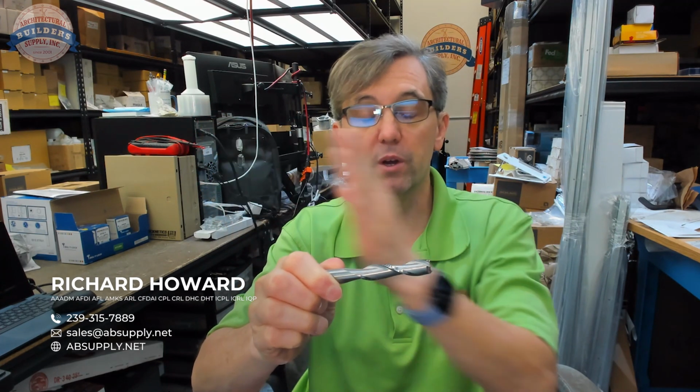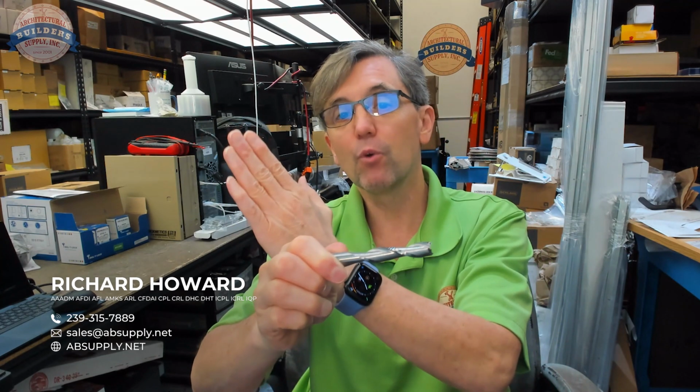As your tool bites into that, the up spiral specifically is designed to help get the chips, the particulate of what remains after you've cut, out of the workspace, which means it declutters that cutting tip area. Okay? It can give you a propensity for uplift, meaning it'll pull back on you. I don't really ever experience that because quite frankly, I take my time when I'm mortising stuff because I don't want to make a mistake or damage something that's really costly and time consuming to replace. So you might get a little uplift on it. It can, I suppose, also give you possibly an unclean edge, but the entire purpose of this is to get the chips out of the area. So if you're doing a deep mortise, this is going to be the tool that you'd want to use.